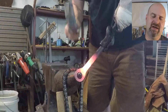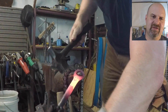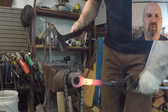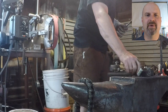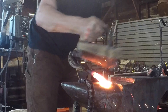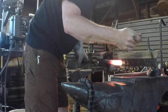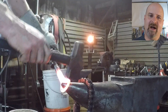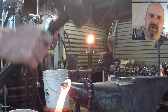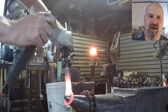After this pass, I'll come back on the horn of the anvil and hit the edges at about 45 degrees instead of square on — that will give it a more pleasant shape. I do it on both sides, and I find that when I'm doing that pass at 45 degrees, it really rounds things up. You can see I'm hitting softer and at about a 45-degree angle to the square face of the opener. That rounds it up and makes it softer in your hand so you don't cut or scratch your hand when you're using the opener.